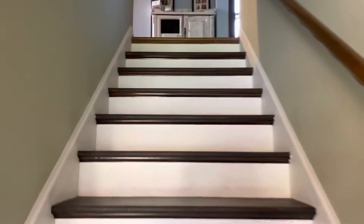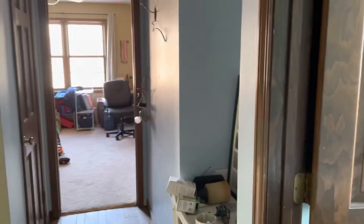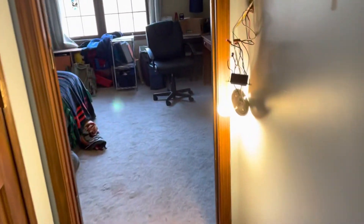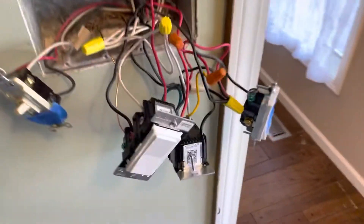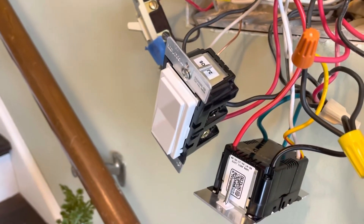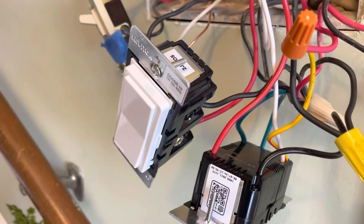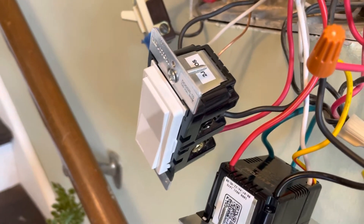I do have good working lights. I've tied in a temporary bulb, but I can turn them off and on at all of my locations, and it works as it's supposed to. None of the switches are a dummy in the line. I had trouble finding the smart switch set up in a four-way configuration — the Leviton variety — anywhere online or YouTube, so I thought I would make a quick video of my setup. I hope that's helpful for someone else.